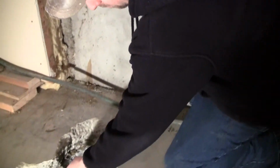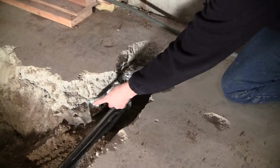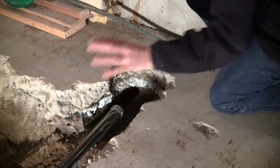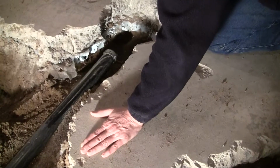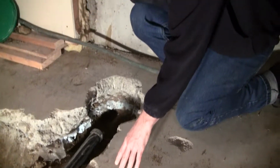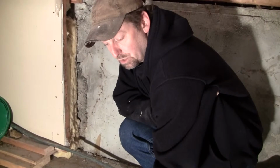And what about the glue on the floor? That's right. With a standard slab with a minimum code insulation here, which is only 24 inches out from the stem wall, the rest of the floor isn't insulated, so it's a constantly changing temperature. And so as a result, you can't put anything really on the concrete without molding, especially if you use a mastic glue, any kind of product that's just glued.